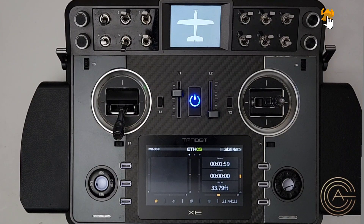This will not work right with the GPS sensor because the GPS sensor is not accurate enough and it has way too much latency. From when it does the reading to when it's displayed on your screen it's about three seconds, because it has to measure distance over time. Airspeed is pretty instantaneous. I have an early video called 'GPS versus Airspeed' where I show both a GPS speedometer and an airspeed speedometer on screen, and you can see how delayed and wildly inaccurate a GPS sensor is, especially during ascents and descents.